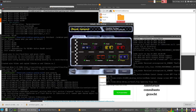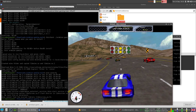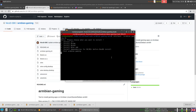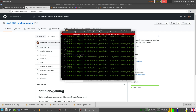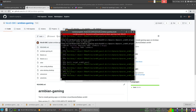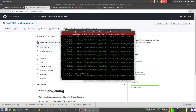We can now run Windows x86 applications and games on our ARM SBC. Now there is only one thing left to do, and that is install Box64. We open the script again and choose number 3 and let it install. This will not take as long as Box86 — it is native ARM64, so that makes it a little bit easier to install. But I again had problems today and had to add a few things. If you have problems with the script, please let me know in the description. Do not go to the Armbian forum — this script isn't officially from Armbian, it's something I made.